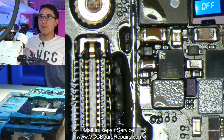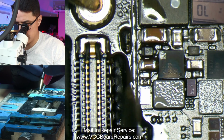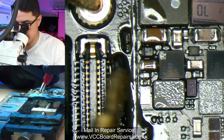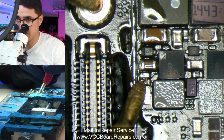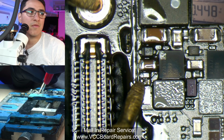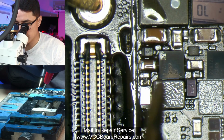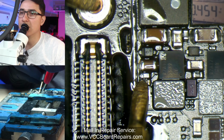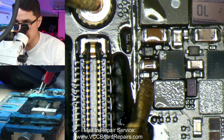Alright, so go back to diode mode. We're going to use the red probe on ground again. This right side is the same thing as the pin connector, and still OL. That means from here to the caps to here is still OL. And on this side, look at that, 445-ish. And it's supposed to be 454. That's pretty close. The heat also affects the reading, so that's probably why it's increasing as it cools down, returning to normal. So yeah, this is where our reading drops off. The circuit basically stops here and doesn't make it to the other end.